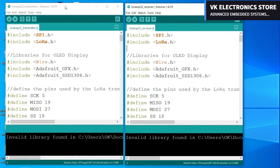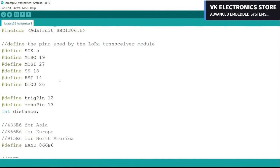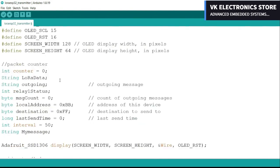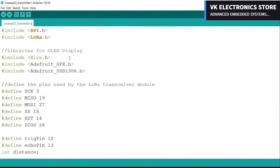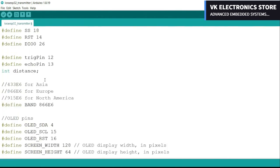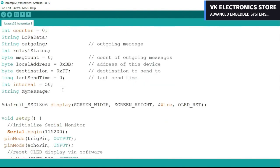Let's go ahead and take a look at the transmitter side programming. If you watch my previous videos on the LoRa 32 and IoT based water level monitoring system, then you would know how I combined the two codes. You can clearly see I'm using the same pins definitions. I'm using the same local address and destination address. If you want to monitor multiple water tanks, then you will have to use these addresses. You can watch my video on how to use multiple LoRa transmitters with a single LoRa receiver. I have added a link in the description.